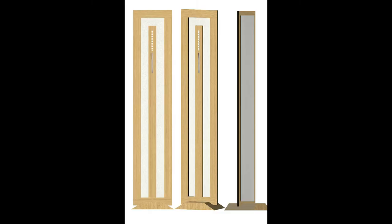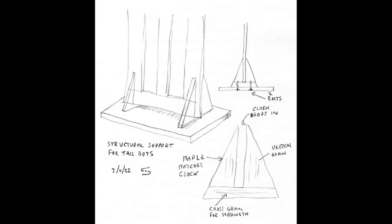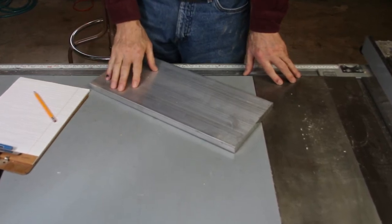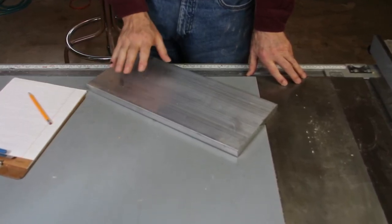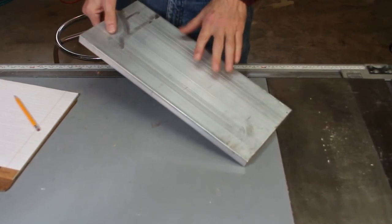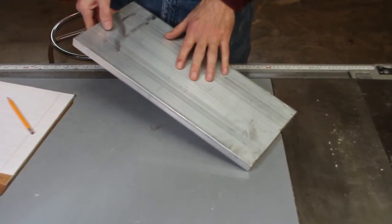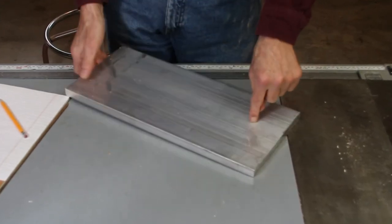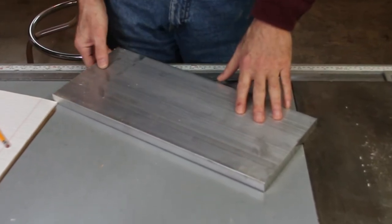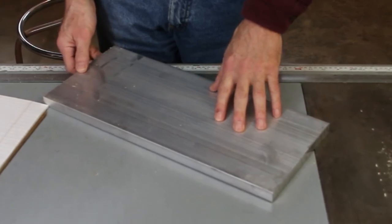Having completed the clock, the question was how to mount it to a base. We tried a solid aluminum base with angle brackets, then simplified it down to steel posts screwed into the base. I found a perfectly sized piece of three-quarter-inch thick aluminum plate, about 18 inches by 8 inches. I'm going to clean it up, bevel it, sand it, and lacquer it, then mount the two bolts that will stick straight up for the clock to secure to. I'm going to use my woodworking tools to work with aluminum — which is a weird non sequitur, but you can do that.